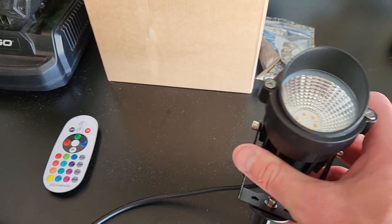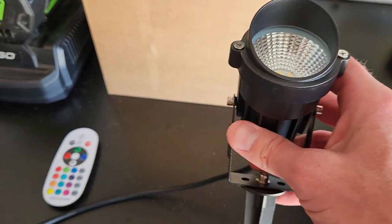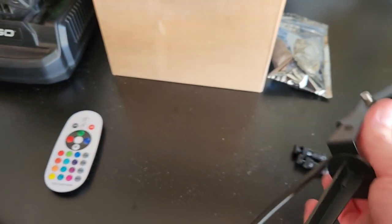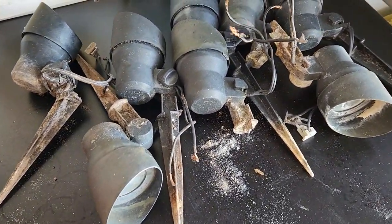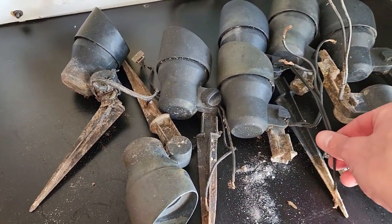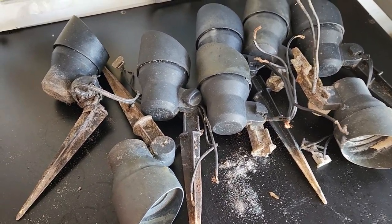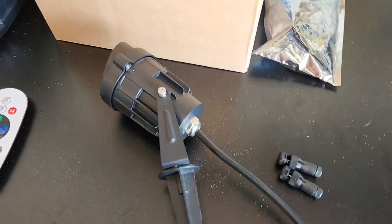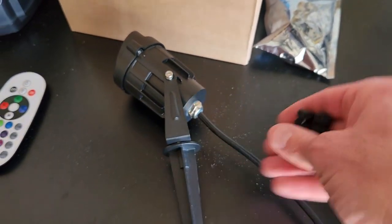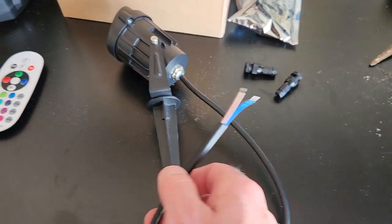But if you want to change it up on the holidays, there are six little LEDs in there and they're super bright — 900 lumens. I've got this graveyard over here so you can see my current 12-volt 20-watt halogen pin bulb lights. I've had these for an eternity; they look rough but they've lasted literally 17–18 years. I'm going to show you how to put the new lights in line with your existing 12-volt Malibu lighting or whatever low-voltage lighting you already have.